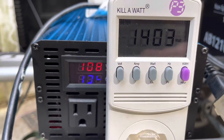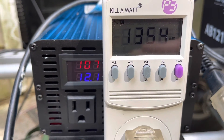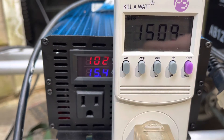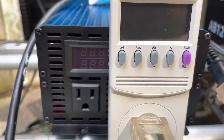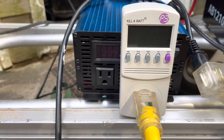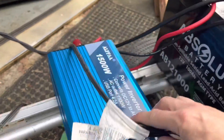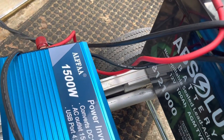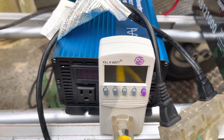The fans just kicked on. We're at about 1400 watts — that's just the low voltage alarm on the battery. No issues maintaining 1300-plus watts. Jumping it up again — we're over 1500 watts right there. Maxing it out now to see where it cuts off. It cut off at just over 1500 watts, spiking due to the inductive heater. This thing definitely puts out what it's rated at as a pure sine wave — it's a good buy if you want a cheap small inverter. Just make sure you're using 6-gauge cable or better because the cables get very warm. We probably could have drawn close to the 1800-watt peak. Hope this helps — thanks for watching, please subscribe.